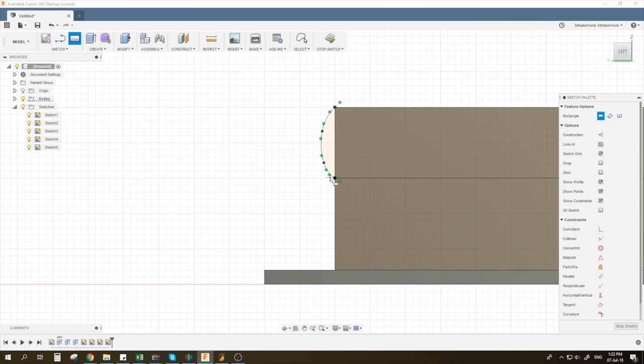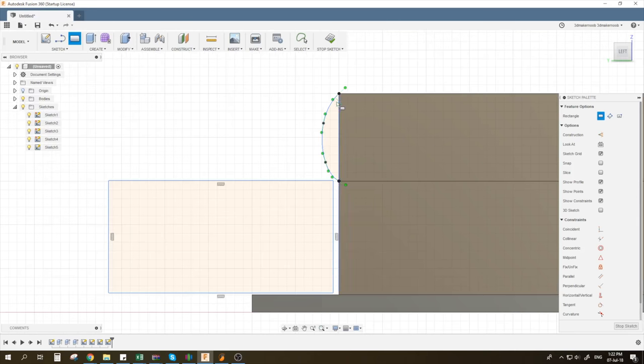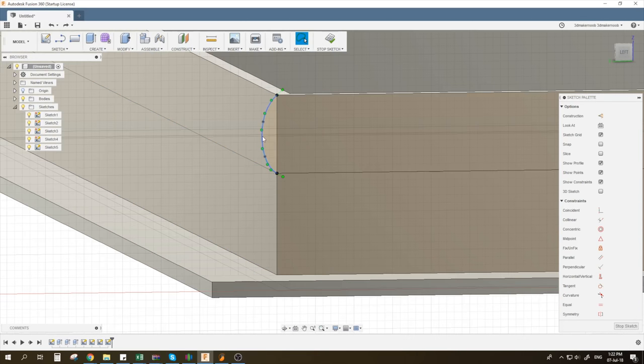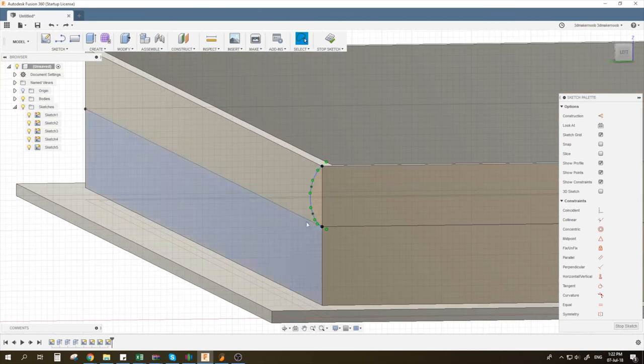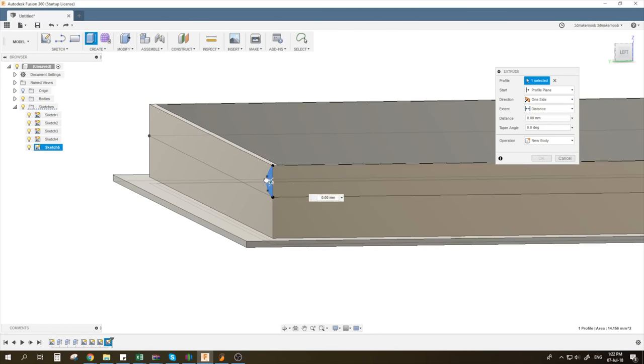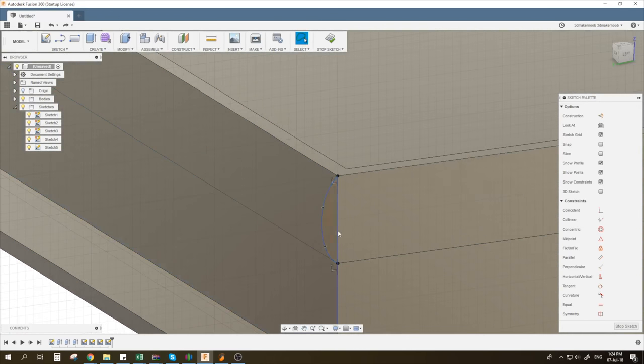And the reason for that is when you have the plaster, let's say that this is the plaster. Once you push the panel inside the inspection hole, these will flex backwards to go through the plaster and then flex back into place and lock themselves in. So I'm going to remove that part there, and this would simply be extruded outwards.